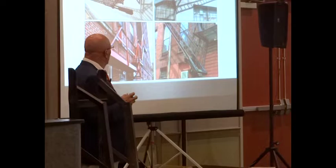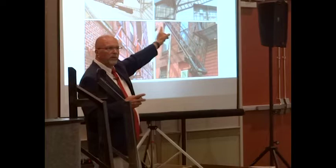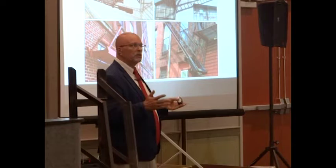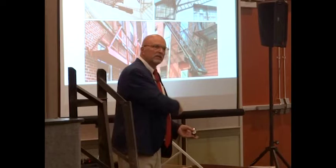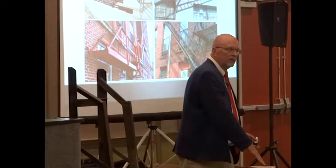Cantilevers? In your city, if you have a cantilever and it has a chain on the back of weight back to the structure in any way, it's out of balance. What you're supposed to have on a cantilever is perfect balance. It's called a balanced cantilever with a release arm on it. Some of them that don't have the release arm, you step out one, two, and guess what happens? It comes down by itself, 2 to 3 feet per second.